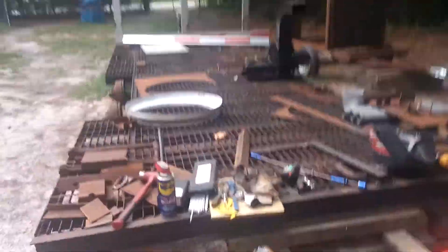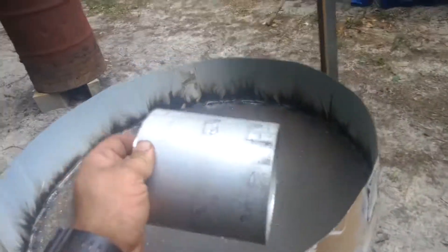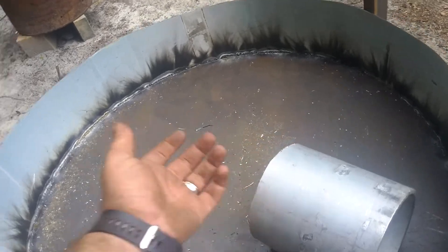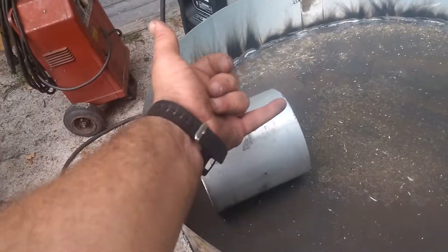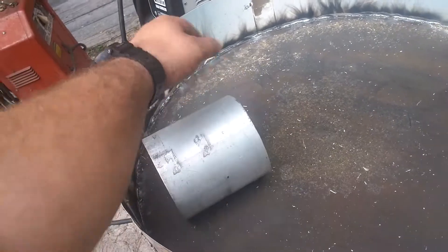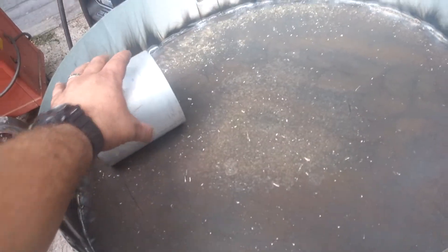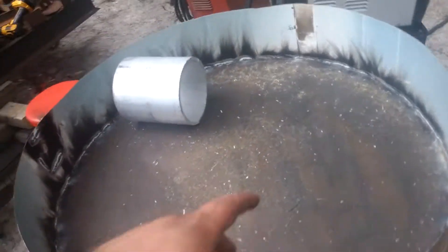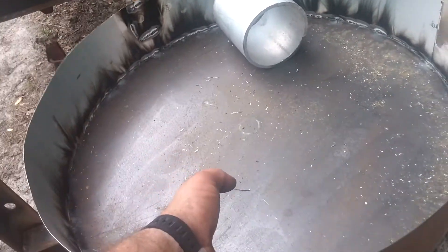The weight that I'm going to make — I got this aluminum pipe over here. I have to go smaller now; this isn't as big as I wanted it to be, but it'll work. I'm going to put a one-inch shaft through it and get it running true with my dial indicator using some bolts, then fill it with lead. So this will be my weight for the green sand. And like I said, a couple of plows — one in the middle and another one over here.